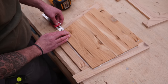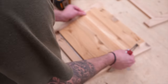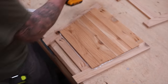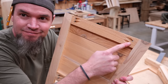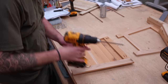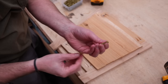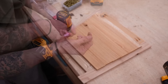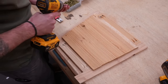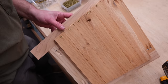If you decide to make these, don't forget to send them to the brag board — link is in the description. I love seeing all the unique concepts you guys come up with. If you notice you've installed the slats on the wrong side of your frame, just shake it off, fix the happy little accident, and keep going. You can install screws in the slats if you want, but with this outdoor wood glue I really don't think it's necessary. If you do add screws, make sure to pre-drill and countersink just a bit to keep the wood from splitting.